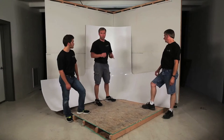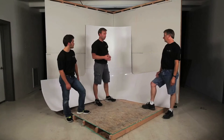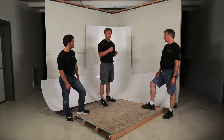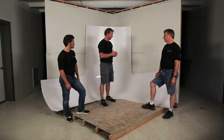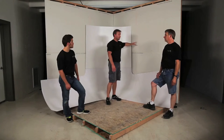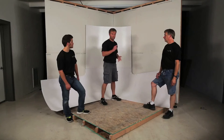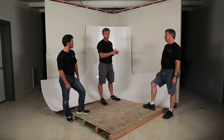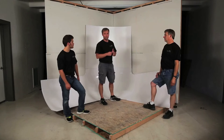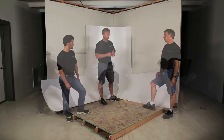Once we have that lined up, we're going to use an eighth-inch drill bit to drill anchoring holes, then put screws in the corner first and continue on all of them. You need to make sure to pre-drill the holes so that it doesn't move around. The furring strips are already behind the second layer of drywall we just put up, so we just need to use long enough screws to go all the way through this layer of drywall into the furring strips.